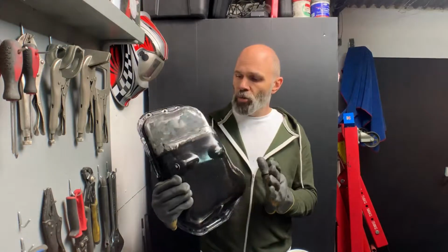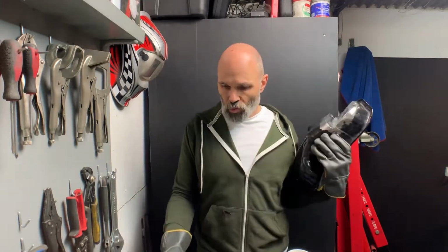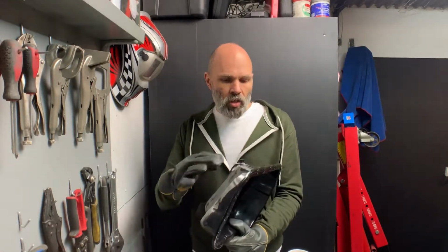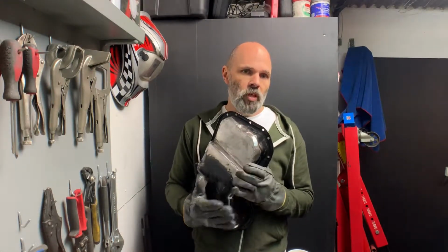Last night I did another water test on this and I've identified a few more leaks. I've got some more water with me today, so I can do a bit of welding and what have you. One thing which did occur to me is that I'm creating problems for myself, just generally. I think what's happening is I'm welding, getting that sorted, and then grinding. Where I've been grinding this down, I think part of these holes, or where I'm blowing through it, is because I'm making the metal a lot thinner.